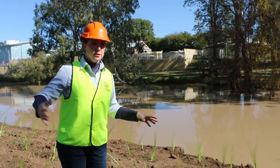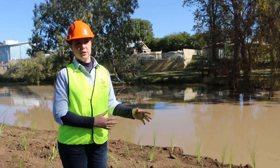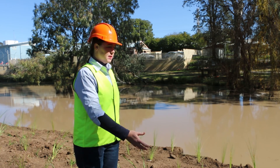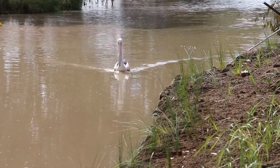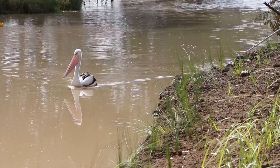We're also aware that the water sheds off the carpark adjacent and off the footpath adjacent, so we're expecting some water flows to be crossing through and flowing into the creek from here. We're wanting these plants to intercept that flow and potentially slow it down and intercept any sediment or debris that might come through so that it doesn't make its way into the creek itself.